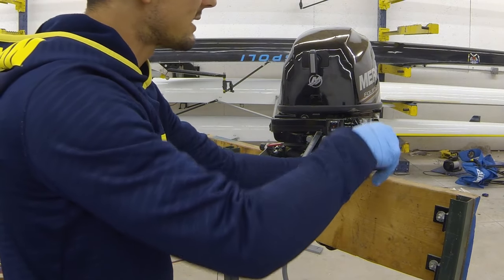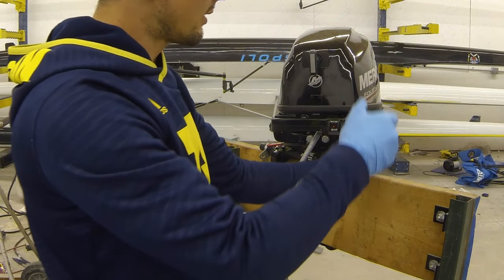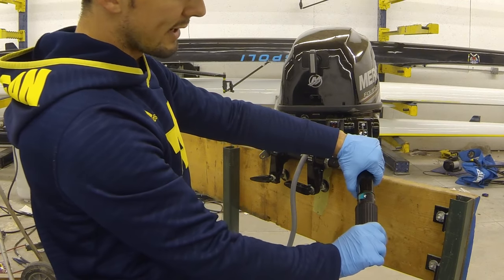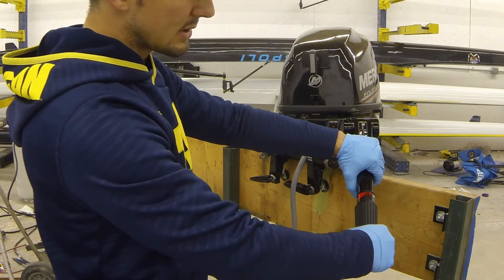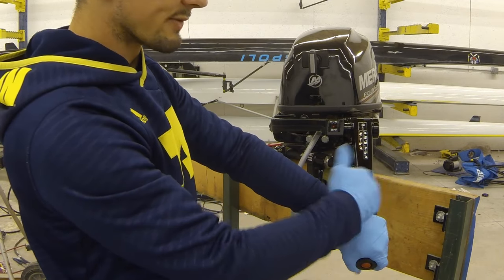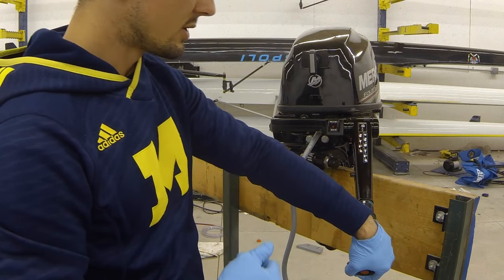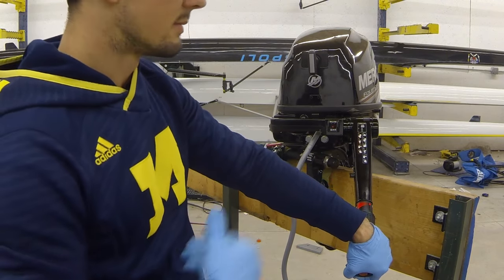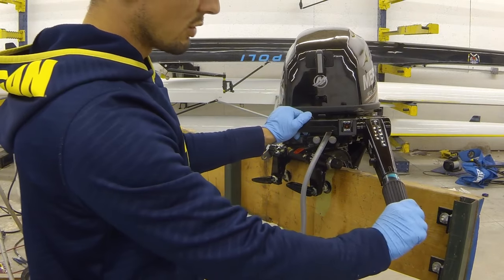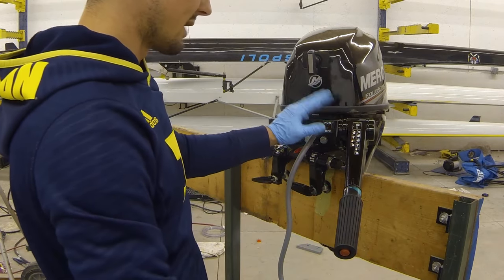On this particular motor — some of them have just a throttle and a lever for forward, neutral, reverse, but this one's a little different. We can push down this little lever here and tilt it to slow down. We have a twist for forward, and then twist more to go faster. Twist back into neutral, twist the other way to go into reverse, and then twist more to go faster in reverse. Be very cautious — you can switch from neutral to forward and reverse very quickly, but you can also get up to high speed very quickly, so you don't want to accidentally twist too much and throw yourself out of the boat. Also be cautious about having the motor turned left or right when shifting into gear, as that can tip the boat. As long as you have your kill switch on, the motor will stop.